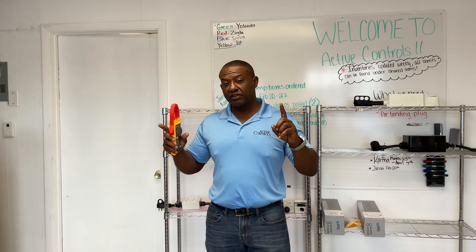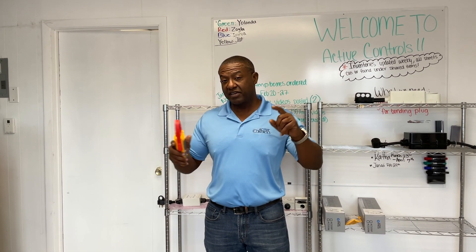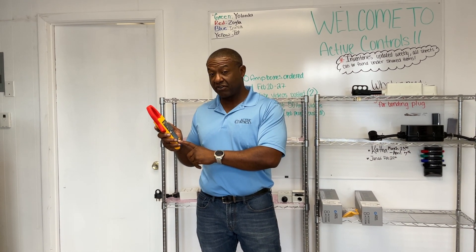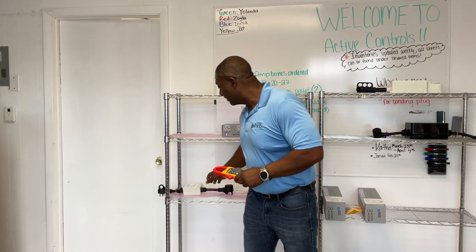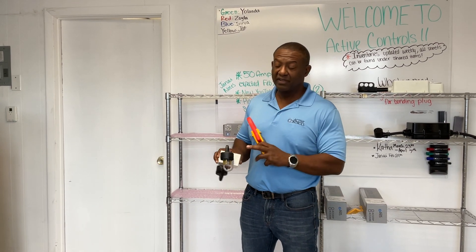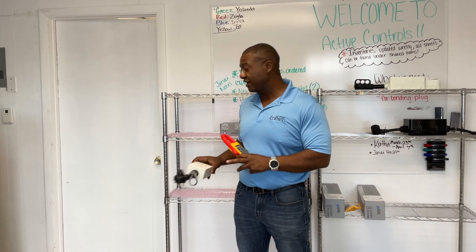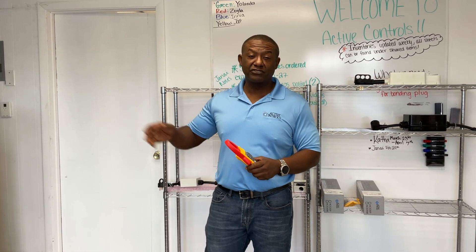Inrush has two components — it's peak over time, integrated over time. This meter does that automatically in the setting called Inrush current. You'll see in the videos I also show a lot of testing I did over the weekend. I used this meter to see what this product is doing and to confirm that we're getting up to 50% reduction. We're not always going to get 50%, but we can get up to 50%. In my testing, I'll show you that I got 40% on one of the tests with a small generator using this meter.